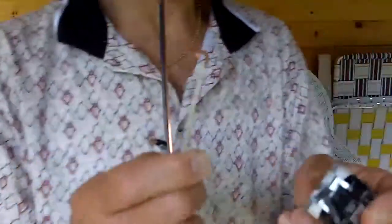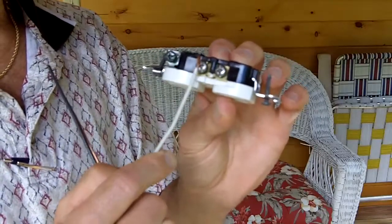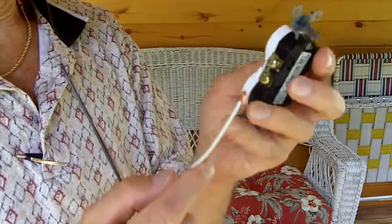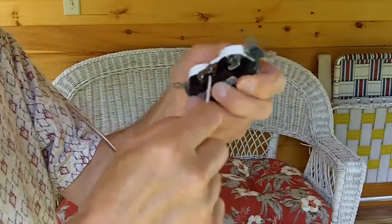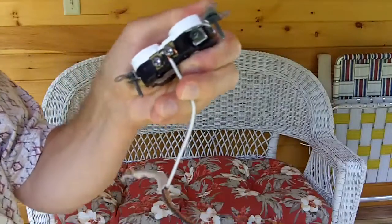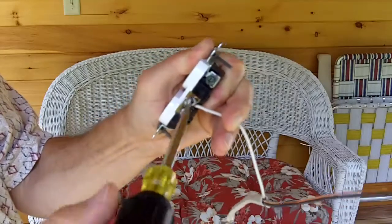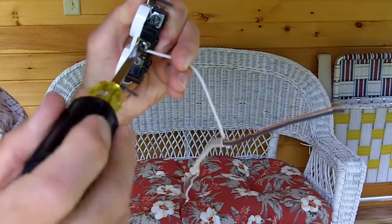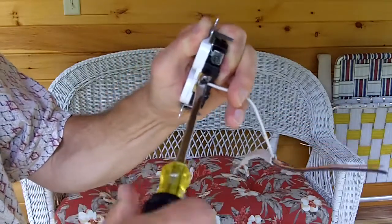This is the white wire. You'll notice the different colors of the posts — you have your silver colored posts, which are for the neutral conductors. On the other side you have the brass colored posts, which are for the black or energized circuit conductor. So we'll go back to the silver post and just hook that wire right around that post like that. Then tighten that up. You want to hold that wire so it's coming off perpendicular to the device, and snug that up nice and snug — snug tight, as we say.